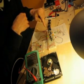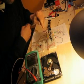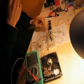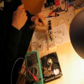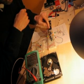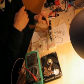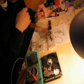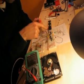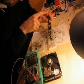I found a little purpose for my LM555 timer circuit. Let's demonstrate the timer circuit first. This is power. I hope you can see this LED blink — it's blinking about twice a second. The capacitor here is a combination of one and a half and a very small capacitor, so it's about one and a half microfarad. The resistor here is a potentiometer — it's now at 250 kilohm, and I can make this light blink faster if I turn down the resistance, making the capacitor charge faster.